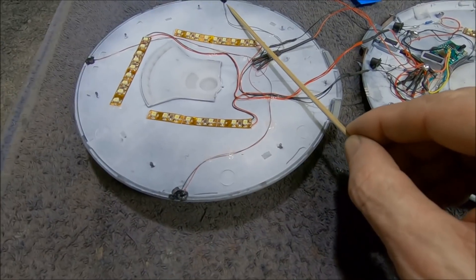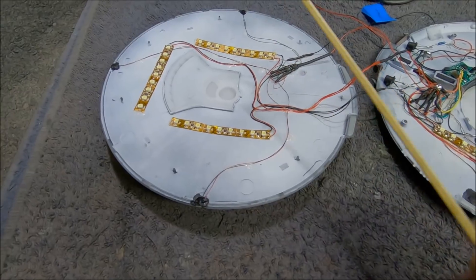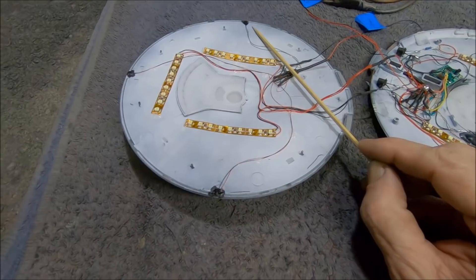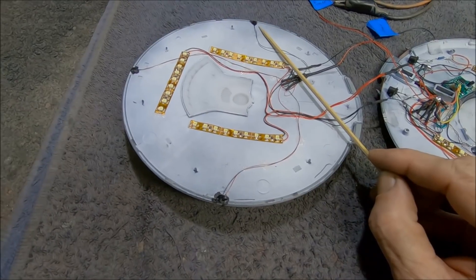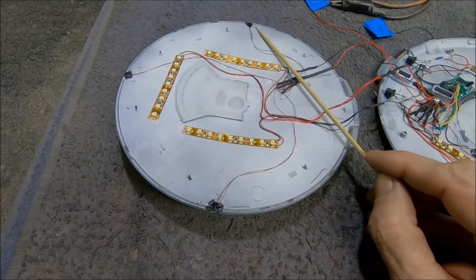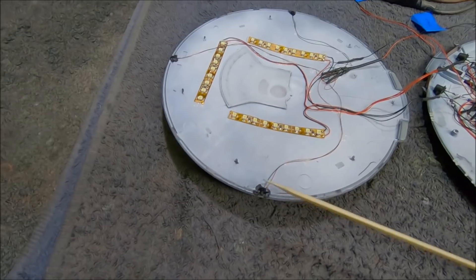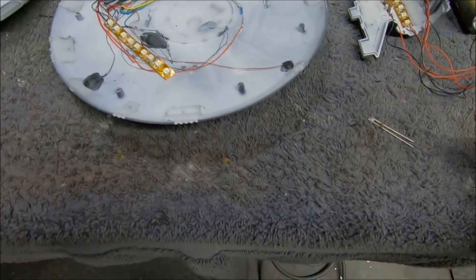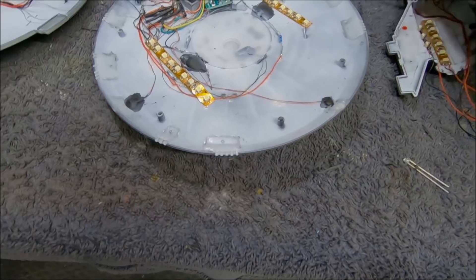So I used 0805s, but I'd recommend going with smaller SMDs — I think they're numbered 6-something. You can check HDA Model Works' website to find the size I'm talking about. There's a size smaller than 0805s that'll probably give you a lot more clearance. I even ground away a little bit of plastic to make more room, but it still created a tiny little gap, so I had to take my Dremel and make a small notch right on the edge of the saucer where the halves meet.